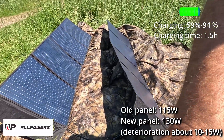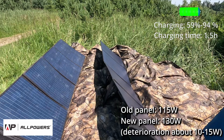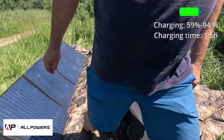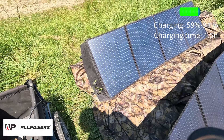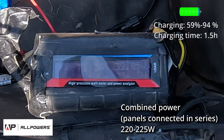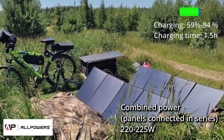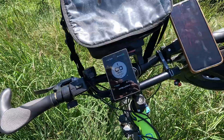Which is actually pretty good. I wasn't even hoping that the old panel would fare so well. Both the old and new panels are connected. Let's see the power generation in series — we have 225W. It's been about 90 minutes, and there is no reason to wait any longer, because the state of charge is already at 94%.